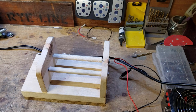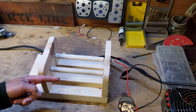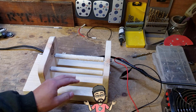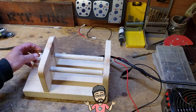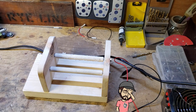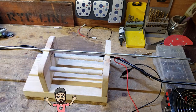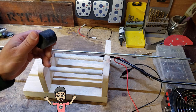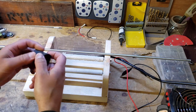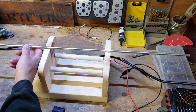There's a slight change of plans — I decided that the little wooden shafts aren't going to work because I'm not equipped to drill the hole really straight into the center. I don't have a good drill press setup or a lathe, so they're a little off-center. Soldering the shaft on the bolt wasn't straight either. So I spent ten dollars at Princess Auto and got a piece of threaded rod. I've also got these little vibration damper bushings — I cut the stud off and drilled through — two of those on each shaft should grip the drum nicely.